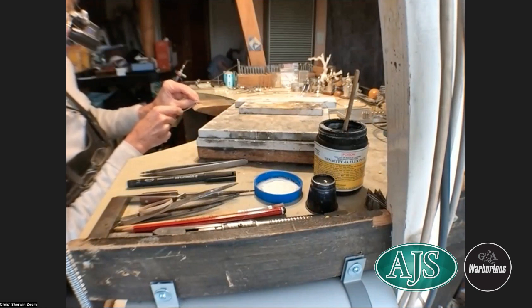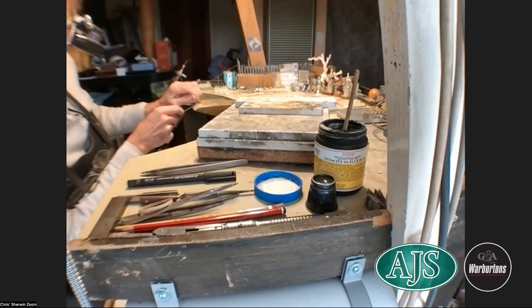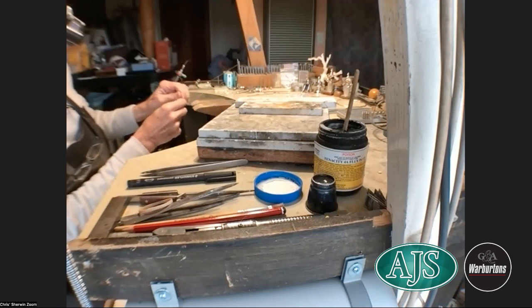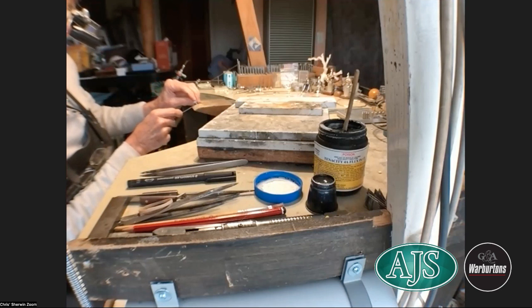You can do it with the back of your saw blade. You can file backwards with the saw blade, do the same thing. But the little groove from the end cutter is very, very handy. And it lets me get around with the rat tail escapement file and widen that groove just wide enough. You're only dealing with a 1 mil wire here, or a 0.9 wire. You really can't afford to chop into the wire too far. You'll weaken it.